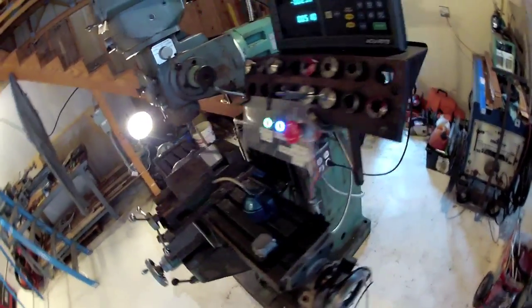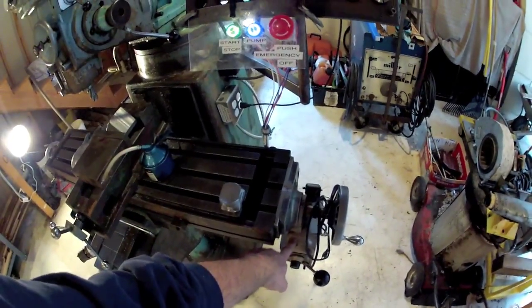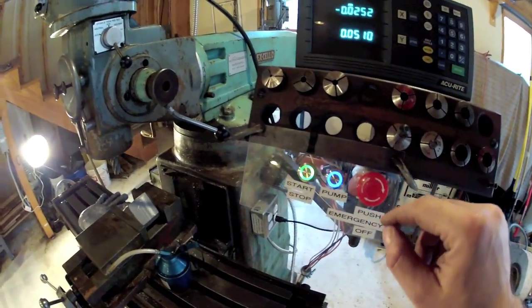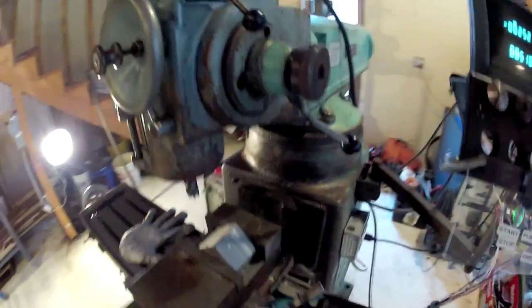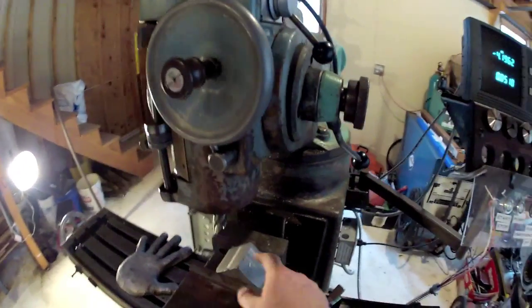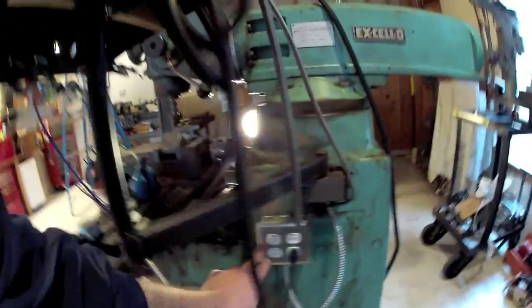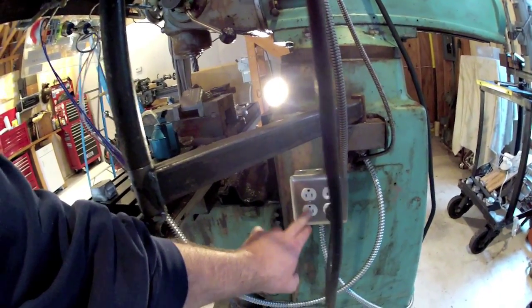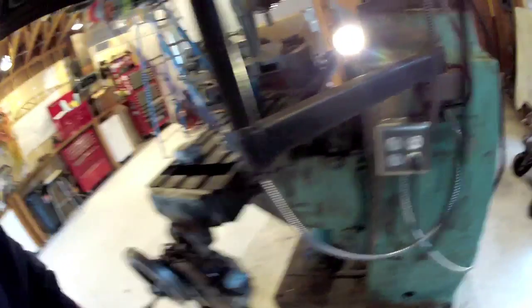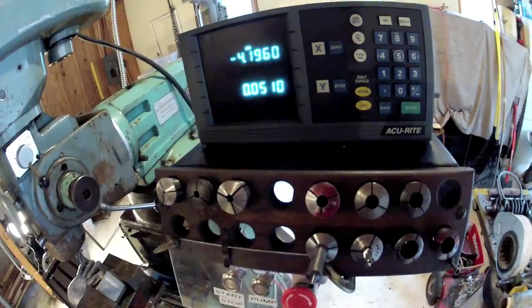The other thing that I thought was fairly important — Mr. Klassen also had the idea of your power feeds shutting off in the event that you push the emergency stop button. The reason is if the bit stops cutting you don't want the power feed continually feeding a stopped bit. With hard work it'll break or shear the bit or ruin the piece that you're working on. So I decided to wire up another outlet box with a switched side that will shut off the coolant pump and the power feeds, and a non-switched side so the DRO can continue to run and I won't have to reset my positions. I also plan to add a spindle light at some point, some sort of gooseneck light that gives me bright light right at the spindle.